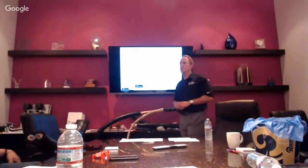But it's rare that we don't get our bundles through the conduit. It's only when the conduits are grossly wrong, I mean, the wrong size. They put in plumber 45s, and they just don't go. If they've been put in right with the right sweeps and things, it works.